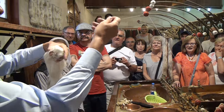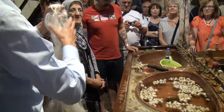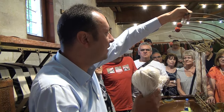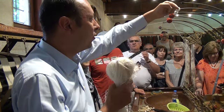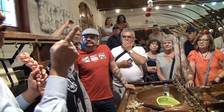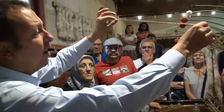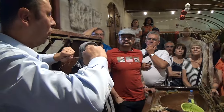Ladies and gentlemen, look here — this single filament is very weak and easy to break. We will take four of these together and spin them — so one yarn has 25 filaments times four equals 100. When 100 come together, we take five of those and spin them in the opposite direction, giving us 500. And here is the yarn which has 500 of these little filaments inside — and this is pretty strong.